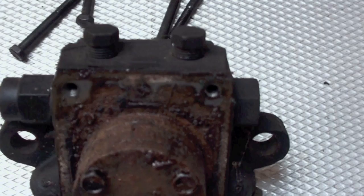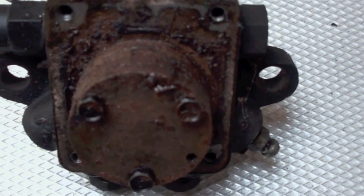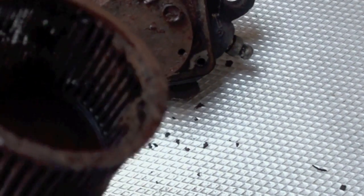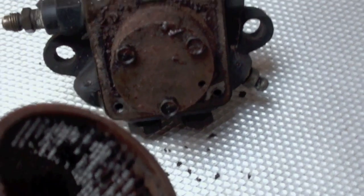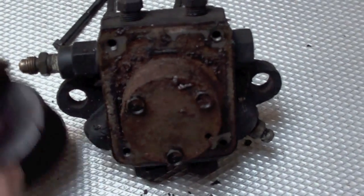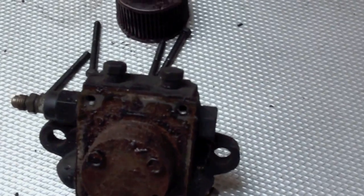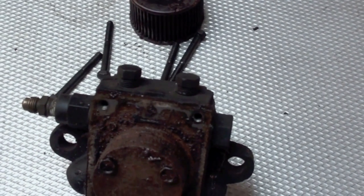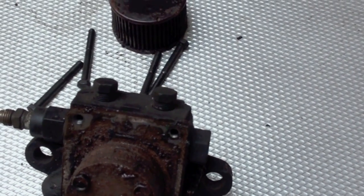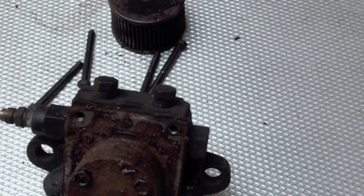You can see what happens when you've got dirty oil — it had water in it, had sludge in it. Even though you had the screen here and the screen isn't completely plugged, it let enough stuff by that the pump just failed. This is a lot of times what you're going to see in these oil furnaces. Many of these things are old enough that there's just been too much water under the bridge to make them continue to run.